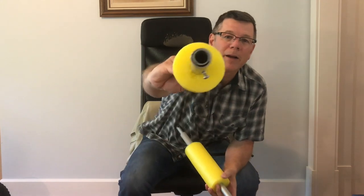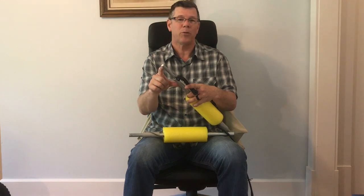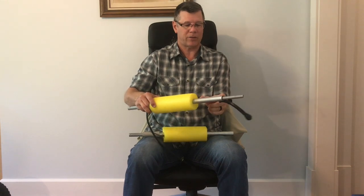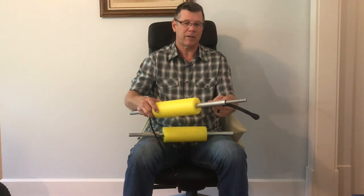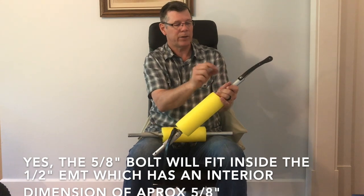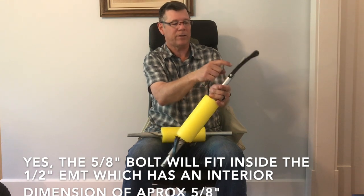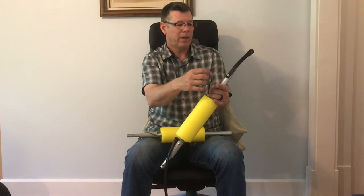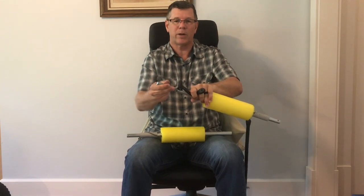Here's a cross section view. This is an eight inch long galvanized bolt, five eighths of an inch thick — the threads are on one section. It's a pretty snug fit and slides right up inside that piece of half inch EMT. I drilled through the EMT and a little bit of the ways into the bolt, maybe about an eighth of an inch. When I run this screw in there, it basically acts as a set screw and keeps that bolt from trying to slide out.